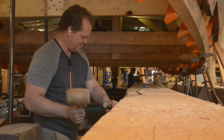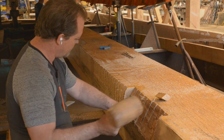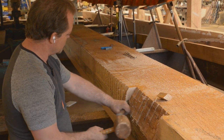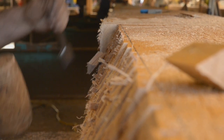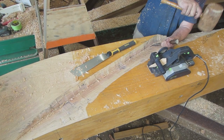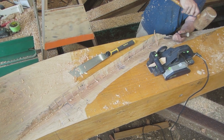I bring my fids in, get the angle proper, and I'll start all that work by chunking out sections with a chisel — just a basic chisel. I've got some nice Japanese chisels that I use for that kind of stuff because they hold an edge really well, until you drop them on concrete. I'll take out a section, two inches here, move three inches and start that curve, then connect the dots. It's a rough section cut out close to where I need it, and I can finish it with a power plane most of the time.